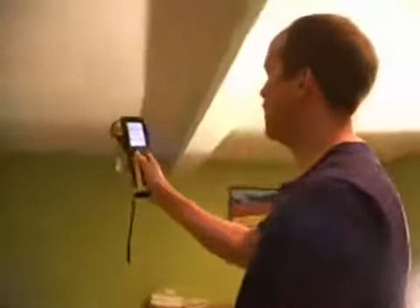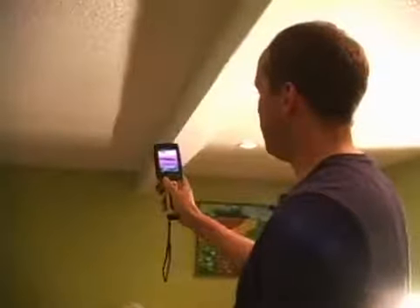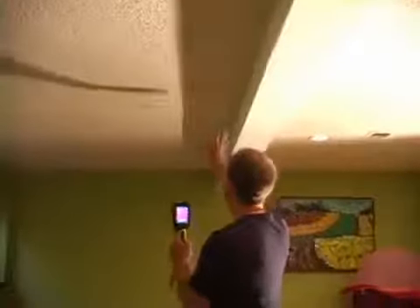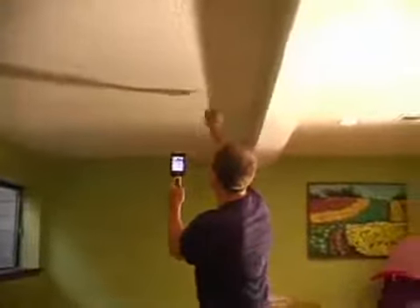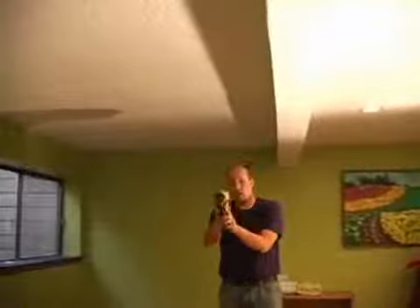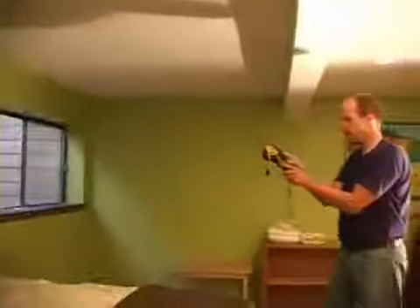Do as much as you can. I quickly see an anomaly — something that really shouldn't be there. It's a water stain here, and now I can maybe see visually where this could be a water area. It's cool here, there are some dark areas right here. Looks like there are water stains. With an infrared camera you can scan a large amount fairly quickly. There are some inspectors who just use the moisture meter, but if I was going to use that, it's hard to scan the entire wall — you'd have to rub the entire wall and ceiling to look for moisture.